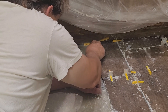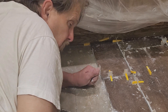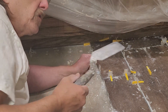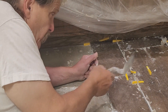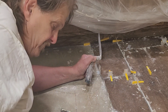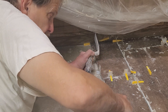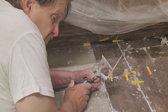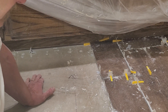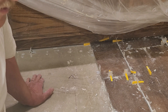That's how you do that. Now if you have any gaps on the edge, you can take your margin trowel and push it in, work it, then clean it off. Hit the edge and make sure it's nice and clean and smooth before it dries, unless you're doing a bunch at one time.